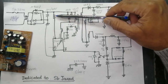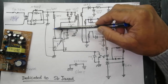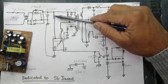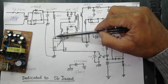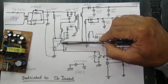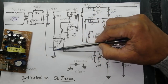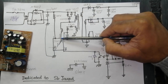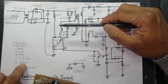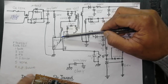The rectified DC voltage of about 310–312 volts is applied here. A 100K resistor provides startup voltage — the STR voltage — to the IC. Initially the IC is off; this voltage is applied to pin 5 (VSTR) to force the IC to start. Pin 1 is grounded to the main capacitor ground and pins 6, 7, 8 are drain pins.